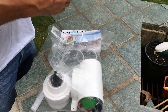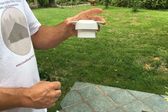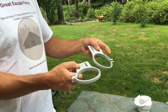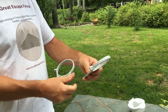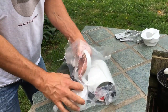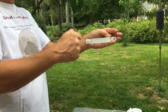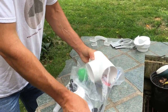Okay, let's take everything out. In a gutter system itself, if you don't have a downspout already, you can put this adapter in and it allows it to go directly to three-inch PVC instead of a normal gutter — we will not be using that. These two pieces here are for mounting if you need to go horizontally or vertically around a corner. I have never used those. What I have used for mounting are these pieces right here — when going vertically against a wall, I attach it and the pipe goes through the center.